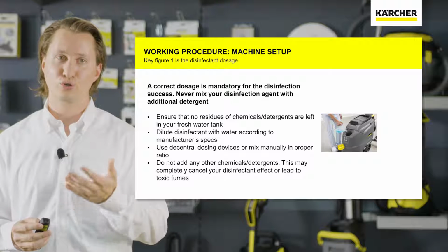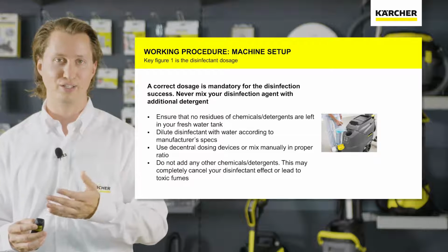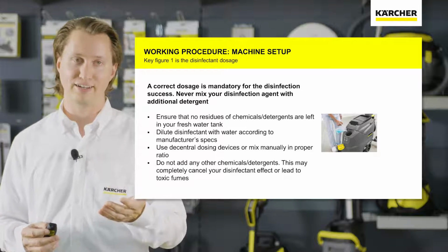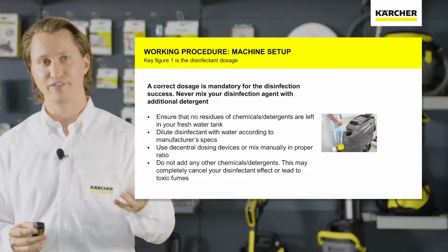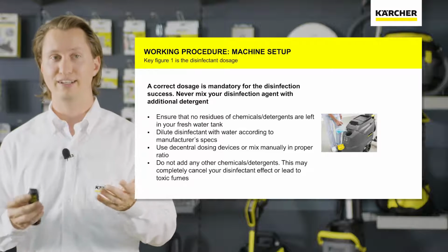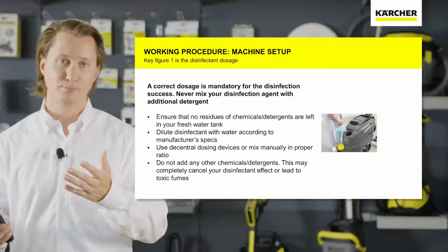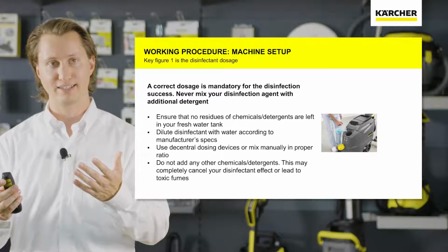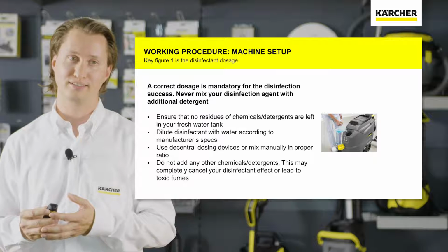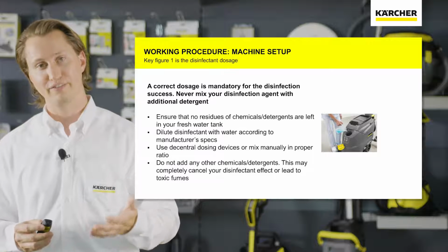First of all, ensure there are absolutely no residues of detergents left in your freshwater tank. This has to do with the different tensides that are used in detergents and disinfectants. Some tensides are positively charged, some are negative. If you have any residues left in your tank, you mix positive and negatively charged tensides, which can completely eliminate your disinfection result. The same thing can happen with detergent residues that are left on the floor.